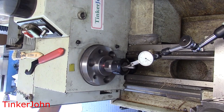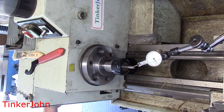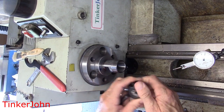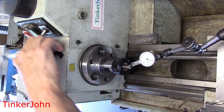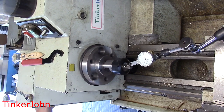I'm going to try a 3/8 inch. What I have here for the 3/8 is a new end mill. I'm going to roll the 3/8 around and see what it's like — and see, that's just all over the board. That's an end mill, and that's just swinging entirely too much right there. Well, that's the saga of the collets. I'm going to just let this sleeping dog lie. Thank you so much for your suggestions and for the many people offering to help. They were very thoughtful suggestions and I tried a whole bunch of them. Because of that, I was able to get a few collets to actually work correctly — but not all of them.